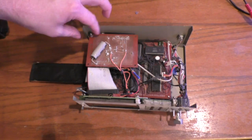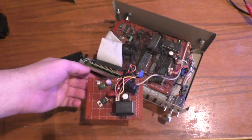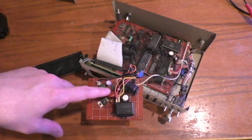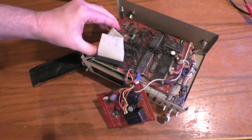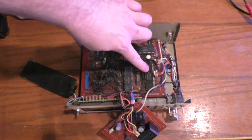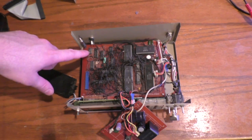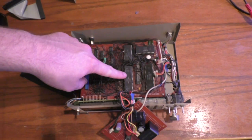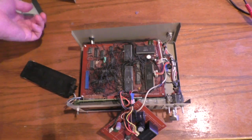The DC-to-DC converter used to be soldered to the bottom of one of the perf boards but over time the solder pulled the pads off, so it's just in the bag for now. There's a power supply board here — removing one nut takes it off. On the power supply board there's a 7805 running the SID chips at 5 volts to keep the noise out, a switching 5-volt buck regulator, some caps, and an audio amplifier with speaker connection.